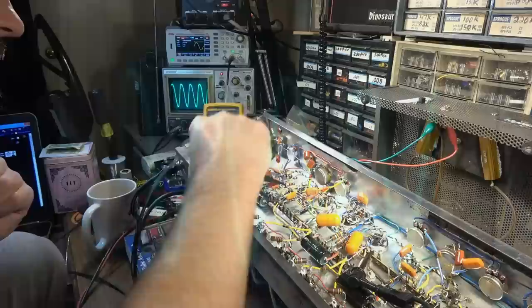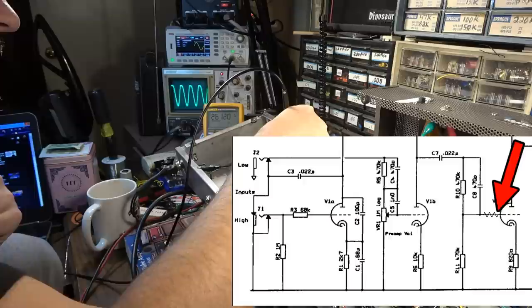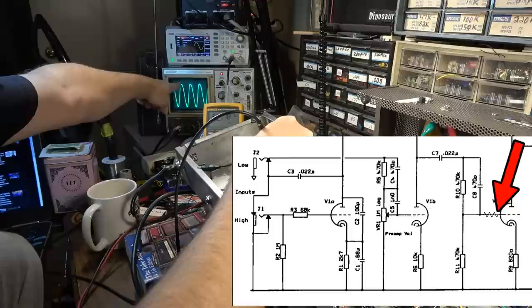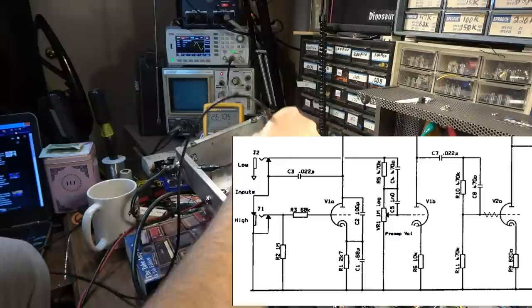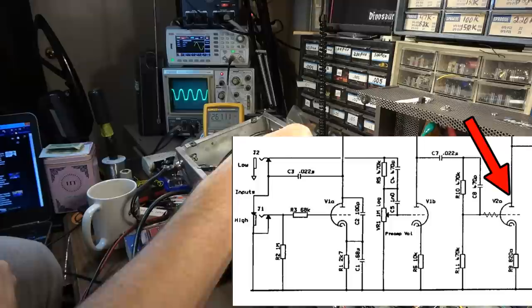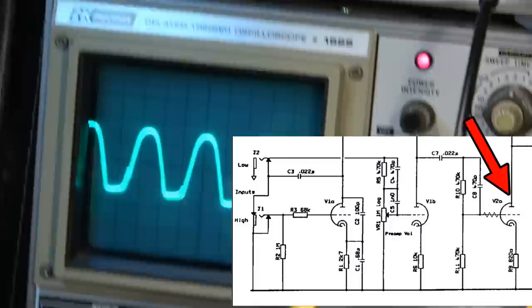Then we go to a resistor that I added because I wanted it to be an input resistor for the next stage. But the problem is, you can see on this top of the wave, it really starts to get a cutoff after that. See there, right there? Really starts to get clipped. And then if we come out of that, after the amplification stage, I have to reduce it by 10 to get it on the screen. You can see it's flipped, so the distortion is now on the bottom, but it's severely clipped now.